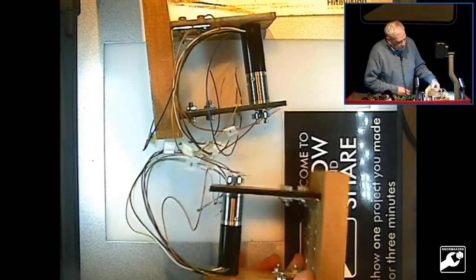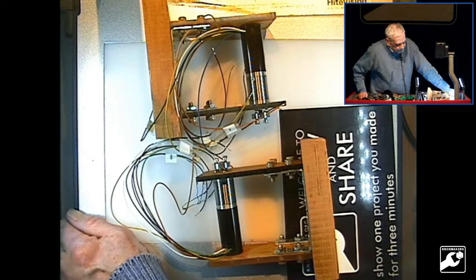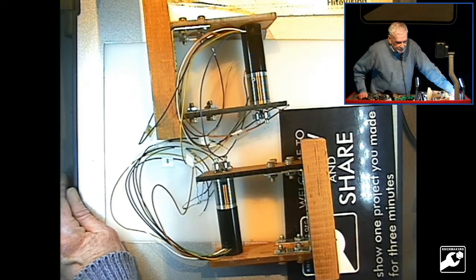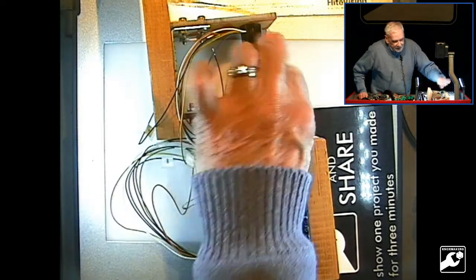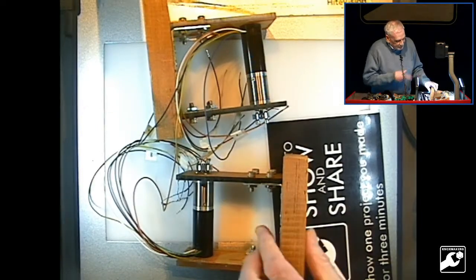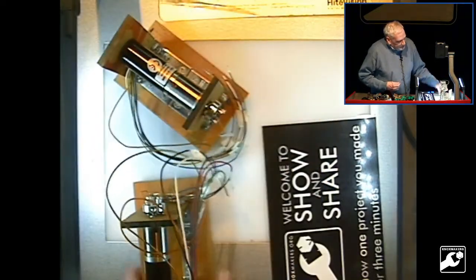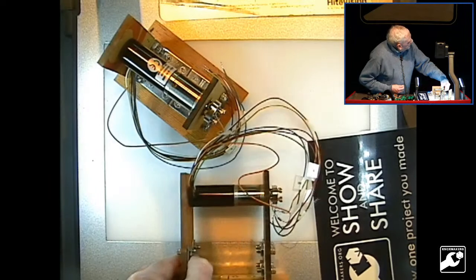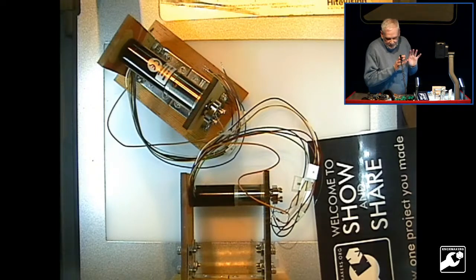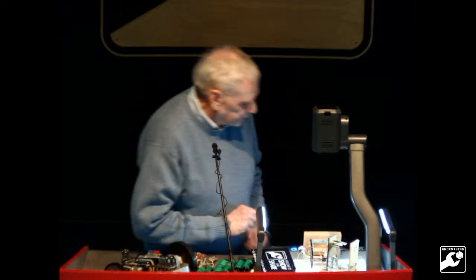brushless DC motors. They're small, but they're 24 volt, 18,000 RPM, no load. But they're geared down to 97 to 1, so I don't know what to expect, but if they don't work, I'll just change them again. I don't know if you can see that. I've never had these running yet. That's my objective.